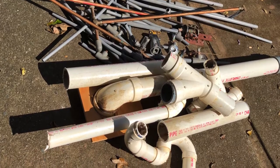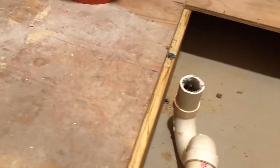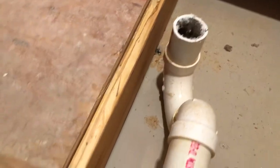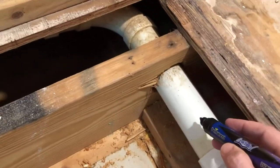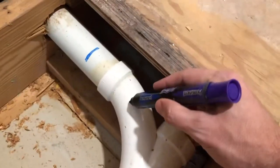We're finally at the point where we need to start cutting out this old PVC. I'll start up here and make a cut right here so I can get out of the joist. Keep in mind that's got water in the trap - I'll probably stuff paper towels in there to soak up as much as possible. This line going over to the other sink with a vent up the wall - I'm going to cut it about right here and tie it back into the new system, so that stays and all this goes away.